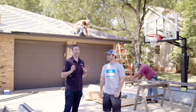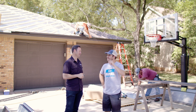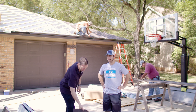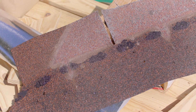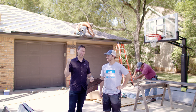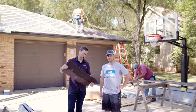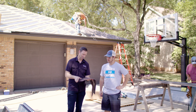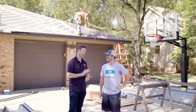Tell me a little bit about it. This is not just any old construction project. We're actually at my house and we are putting on a long-awaited, much-anticipated metal roof. I've been putting metal roofs on clients' houses for 15 years, but this is actually my roof prior to the metal. This is like the real confessions of Matt Reisinger. I've talked about metal on my YouTube channel for all 11 years I've been on YouTube. And yet, I've been living with a shingle roof. This shingle roof was fairly new when I bought the house 11 years ago — maybe five years old, just a cheap three-tab. It's way at the end of its service life. You could literally see the fiberglass, most of the granules are gone, it's weeping asphalt. It was time, man.